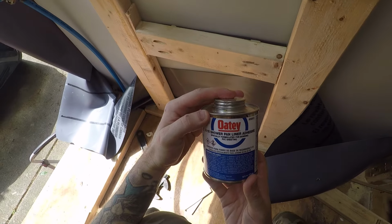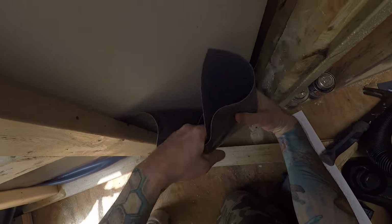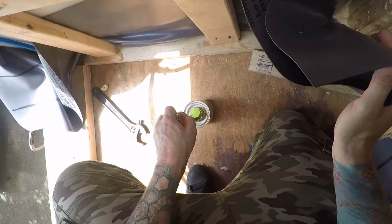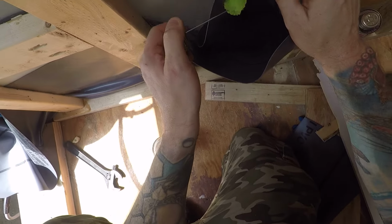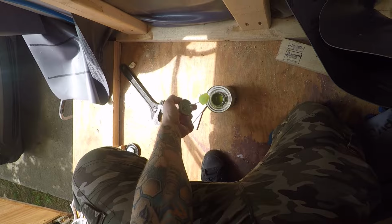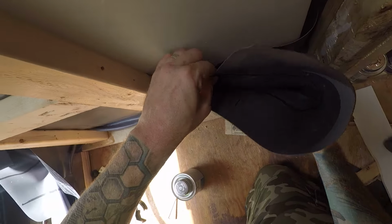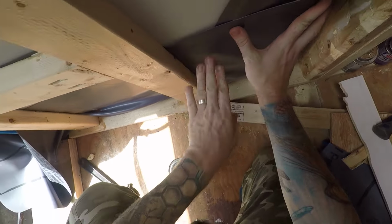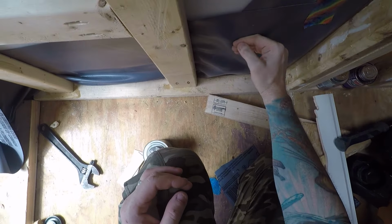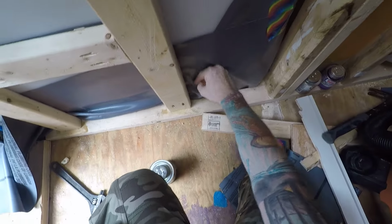This is X15 shower pan liner adhesive. It's made for this PVC shower pan liner. And basically I'm gonna fold this guy over here. I'm gonna fold it so then I can put some shower pan liner adhesive here. You know, I can glue this whole thing over here so it's not flopping. And I'll temporarily tape it so it stays like that. That's gonna get glued there.